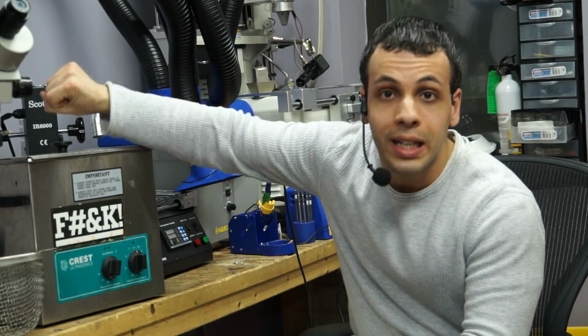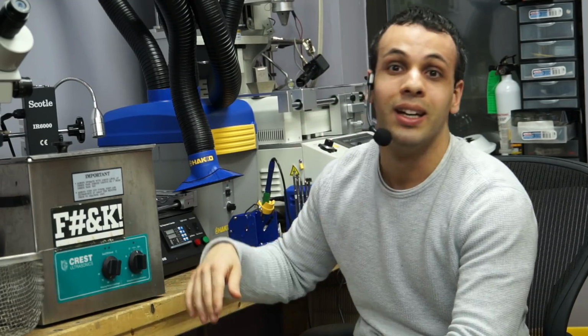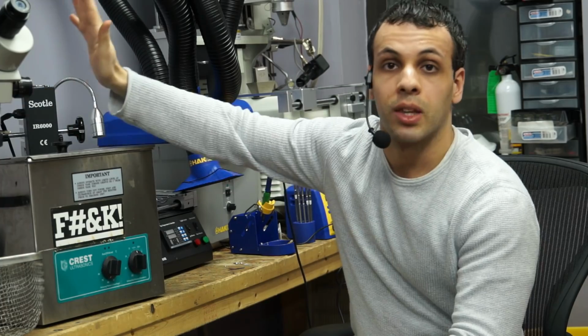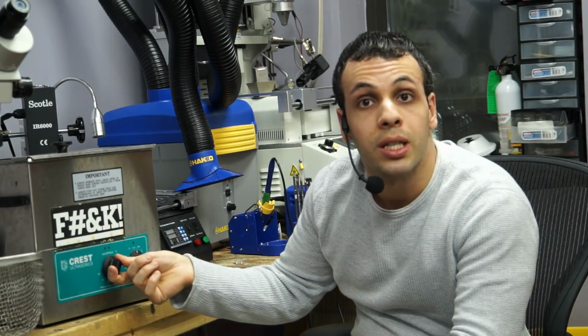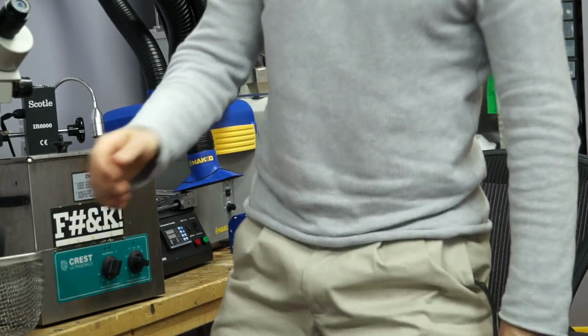So you pour 1 gallon of, and I'm going to repeat this over and over again because there's so many people who just refuse to listen to anything I have to say. 103 milliliters of Bransonic EC, 1 gallon of distilled water. Then you turn this thing to 65 degrees. You turn it on. Let me get a power cord so I can turn it on. You can see the lights.